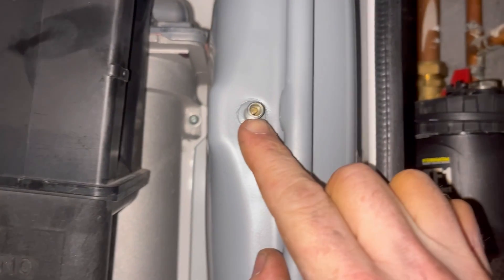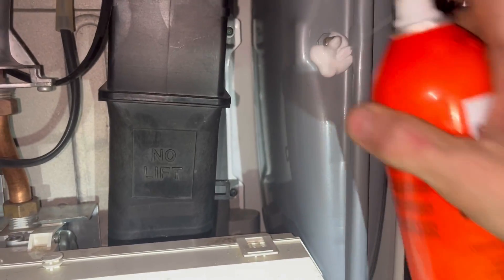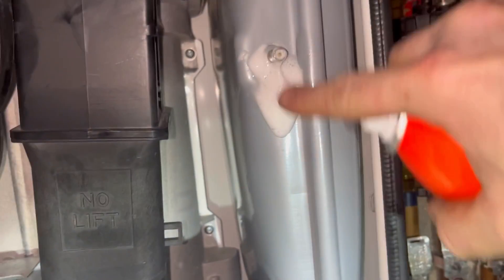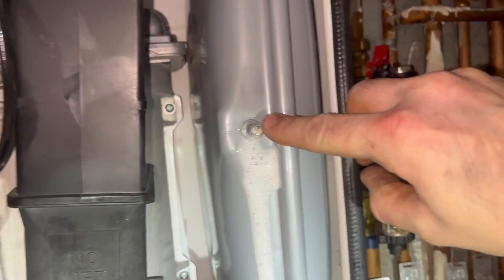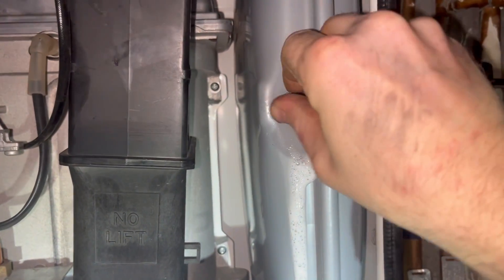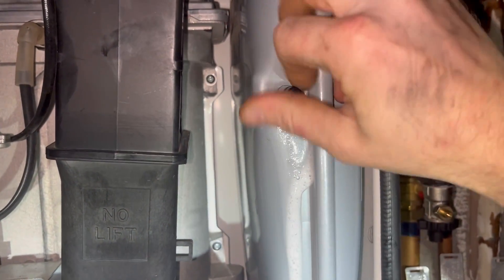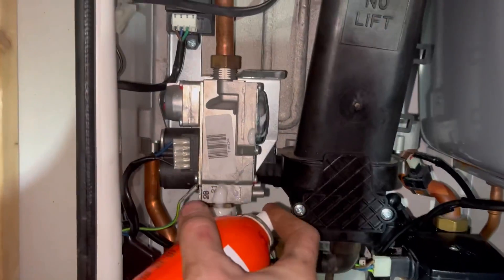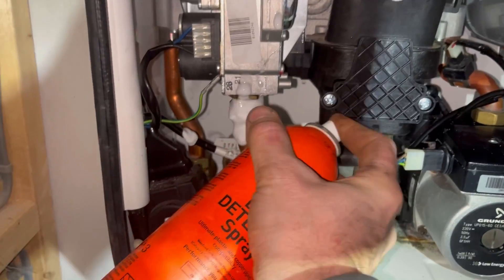Put some LDF on that — make sure you don't get any bubbles. There's a bit of LDF on there. If you get any bubbles on that you've got to replace the Schrader valve — it's not only the expansion, it's the Schrader valve that always needs doing if it leaks. That looks good — let's put that cap back on.